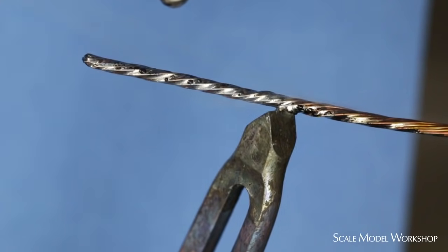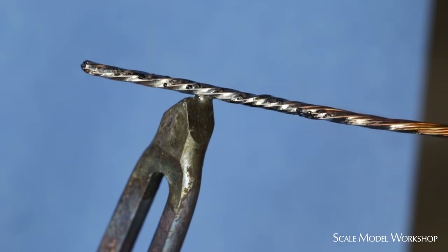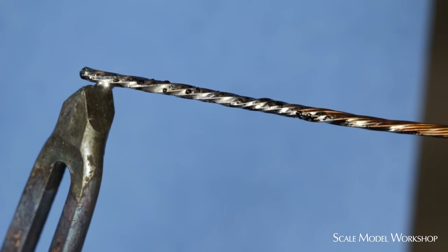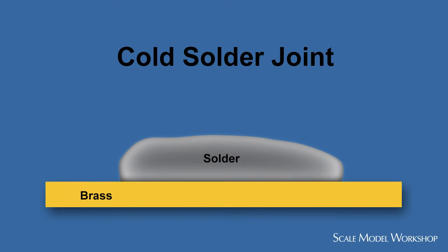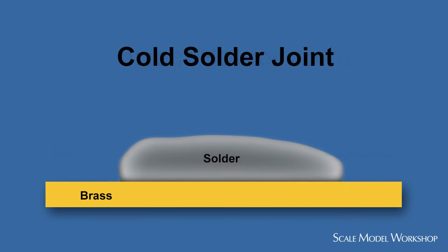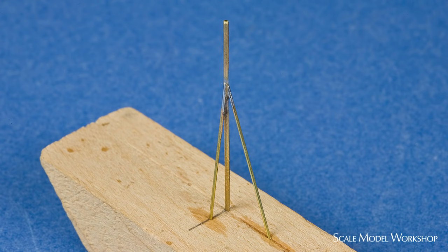This is why it's important to use an adequately large heat source. Trying to heat a large area or bulky piece with a dainty soldering iron will generally result in frustration because there will be so much oxidation that the solder won't flow, and the result will be what's known as a cold solder joint. A good solder joint will appear shiny and the edges of the joint will blend into the surface of the metal. A cold solder joint will look like a blob and frequently have a dull, rough look. A cold solder joint also results if the pieces move while the solder is cooling, so it's important that the pieces be securely held together.